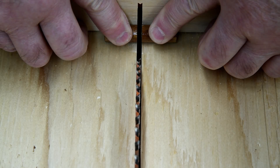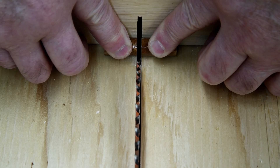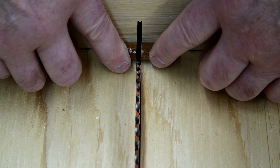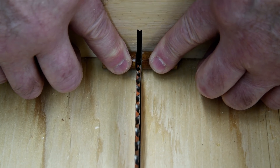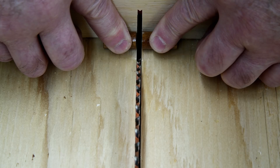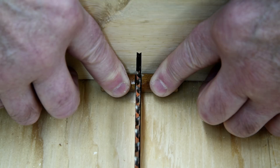Here's a tip for you: if ever you're going to cut something that's round with a high-speed blade like this, it's extremely important that you're holding it as tight into the corner as possible. The reason being is it could grab a little bit and start to rotate, and once it starts it just keeps going and you're going to have a humongous catch. I didn't have the camera running while I was doing this because I wanted to give my full concentration to what I'm doing. With my knee, I turned off the saw and let it coast to a stop before I brought it back.